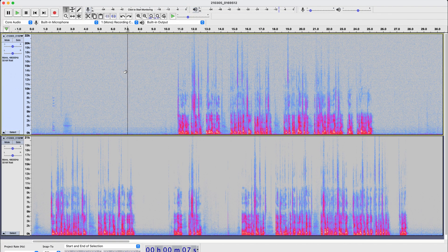As another test, I've opened up the two audio sample recordings — with and without the Fethead — in Audacity. Using the spectrogram view, the x-axis shows time and the y-axis shows frequency, so you can see what frequencies are loud at what particular time. This really visually shows the difference. Down in the lower frequencies you can see my voice, but in silent periods there's all this noise and static. At higher frequencies, above my voice, the recording without the Fethead shows constant noise — whereas in the Fethead recording that static totally disappears.